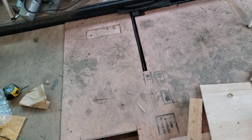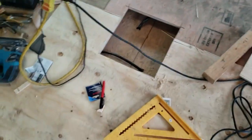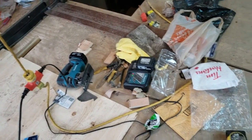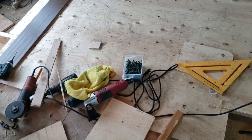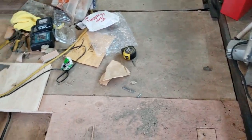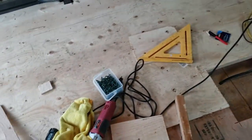I'm going to continue on with the other side. Before I do, I have to pull this back up and go along and screw all this plywood down permanently. I've only got enough screws in it to hold it in place — I didn't want to put a whole mess of screws in if I had to move anything. I'll screw it down every six inches or so, and then the three-eighths can go on top and it'll be ready for flooring.